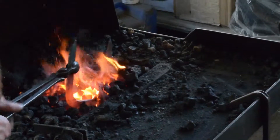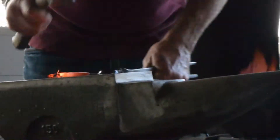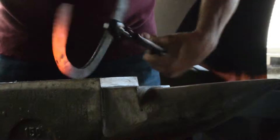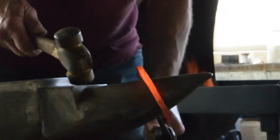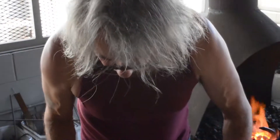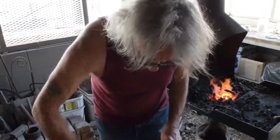Get a little off there — and that's another thing. If you need to make an adjustment, just put it back in the fire and heat it up some more. Or as the old blacksmith would say, get the son of a bitch hot and hit it. So we even it up by hitting it in a certain place. I just corrected that with a couple of blows.